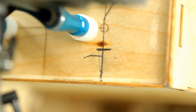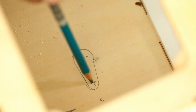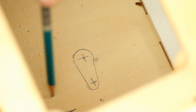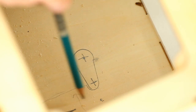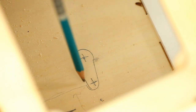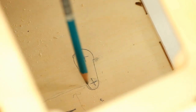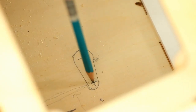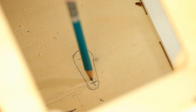Now on the inside, we need to figure out where we're going to place our servo. Inside the engine box, I measured over from where that rod is going to enter into the firewall. I took that measurement and created that measurement here. And then we already decided in our previous diagram that we wanted this to be 3 inches back from the firewall. So this is 3 inches back from the firewall and then the same distance over from where our entry hole is on the outside.